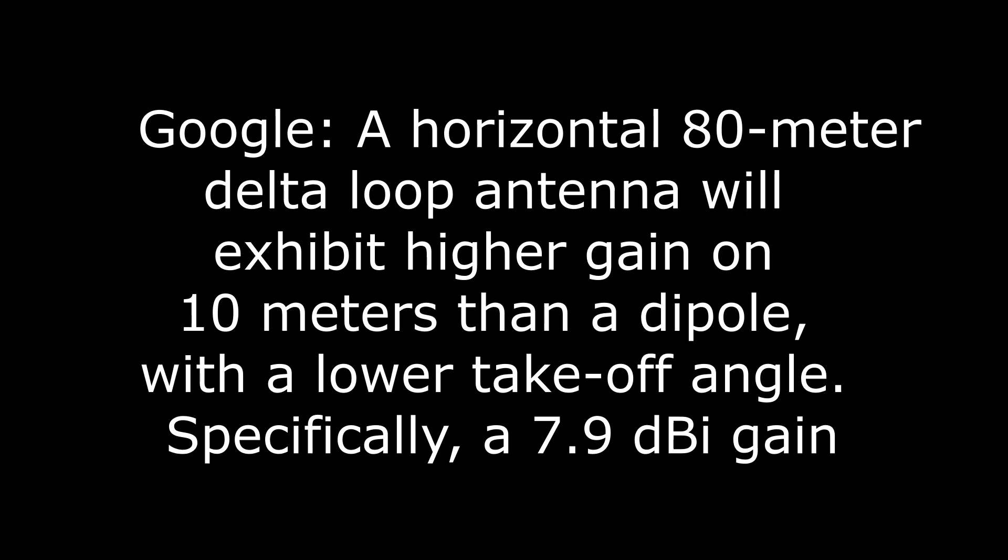I have a little less noise than I had on my end-fed, which is good. And if you look at the gain chart for an 80-meter full-wave delta loop used on 10 meters or even 20 meters, look at how much gain you have — it has some lobes, but all in all it's a great antenna. Thanks for watching, we'll catch you later.